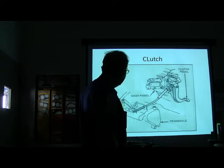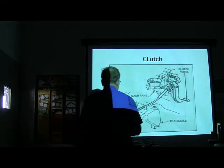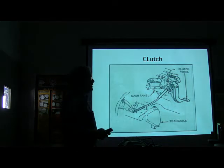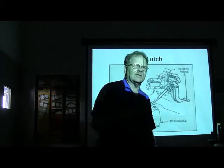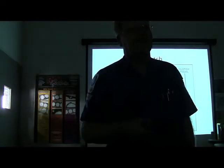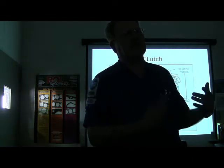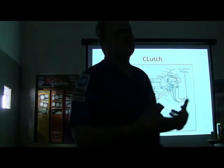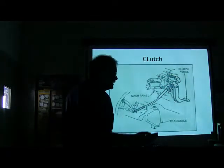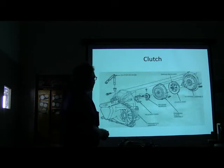This one here — basically you've got a clutch that's operated with what? What's the mechanism by which the clutch operates? Now Quincy, when I replaced the clutch on the one, you just pull the transmission out and put it back in. Remember the slave cylinder that you had to hook up to the clutch? That's a hydraulic clutch. And on that one, it gets its fluid from the regular brake master cylinder.